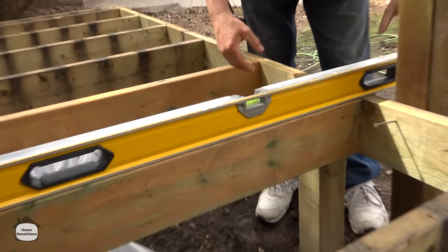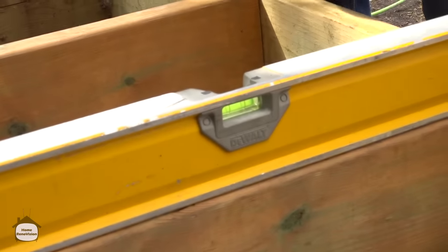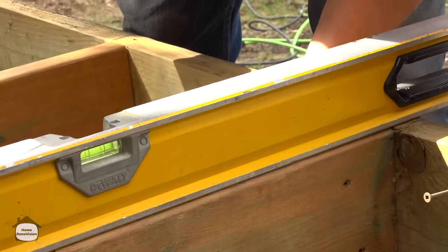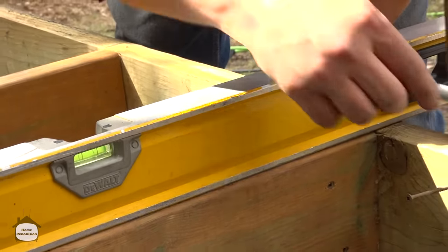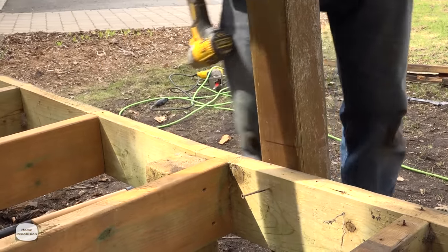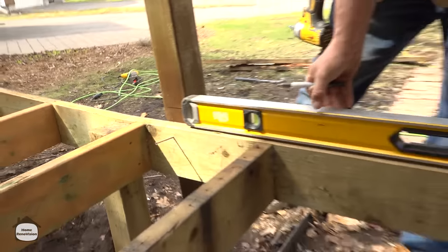Legally, what this other homeowner did there's nothing wrong with — it was lousy but it wasn't illegal. I'm throwing in some limestone screenings to level this off, then I'll drop in a concrete slab. The idea is to get the block right there — perfect. If I'm an eighth of a degree off level I'll be perfectly happy with it. That's structurally sound. I'll throw this on our new piece of wood going right from one side to the other, mark my post where I want it level.